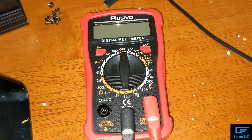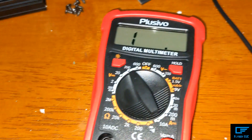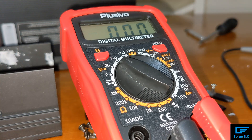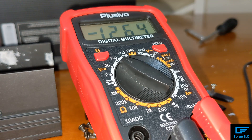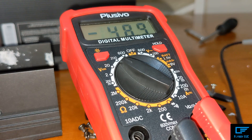Now I will show that to you. The charger's on and plugged into the wall. Set the multimeter to a maximum of 200 volts. I'm putting in the red lead into the number five hole, and now I'm sticking the black lead on the back of the charger. I'm measuring 126.4 volts — that's good enough for me. It's a little bit over 126, so we'll see if that works.